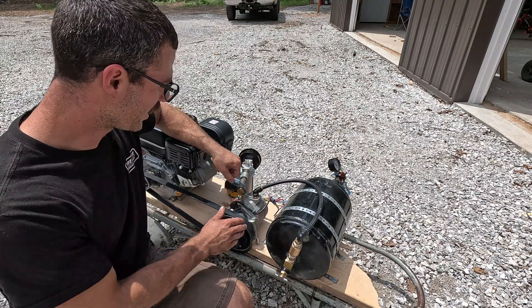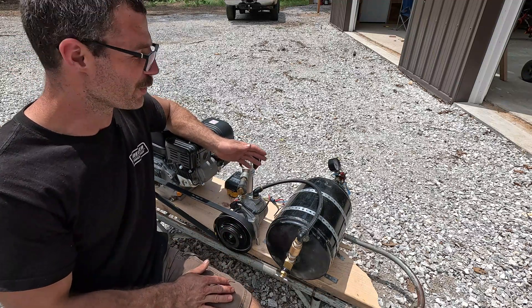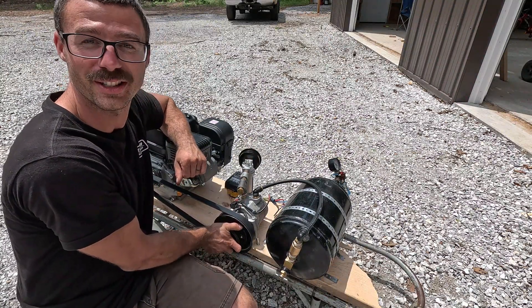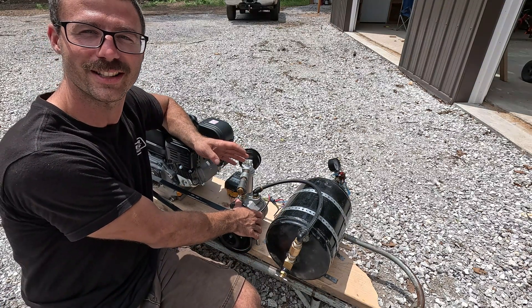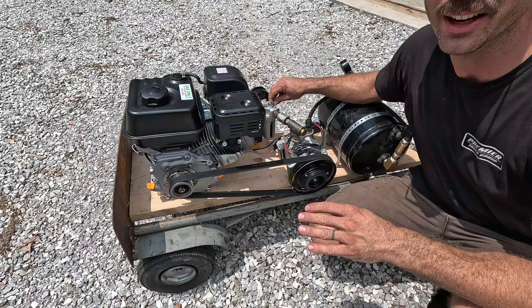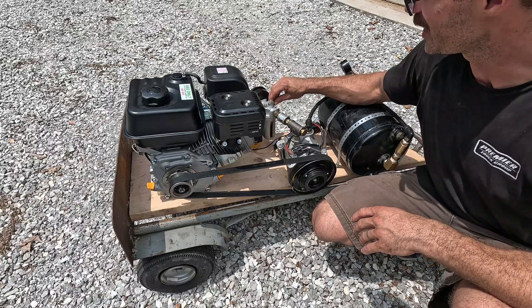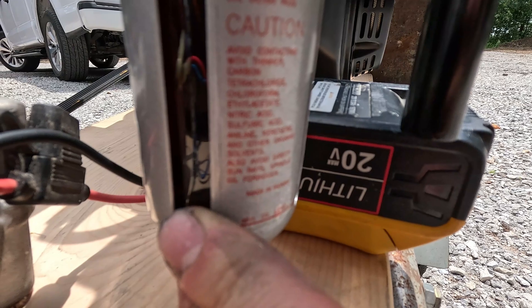After about an hour or two of cool-down time, the compressor has definitely cooled off. I think it was the temperature switch, because I can now engage power and the clutch locks up. Since that temperature switch is in line with the clutch, it kicked out on its own — which is a good thing; it probably kept this thing from burning itself up. I do think I had the oil turned up too much. While using the air tools we noticed a lot of oil smell in the air, so I'm going to turn the adjustment down. I don't see any noticeable drop in the oil level, so it's being pretty frugal.